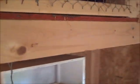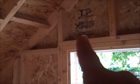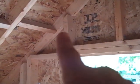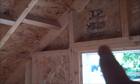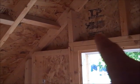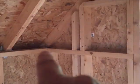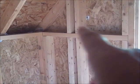And for the wall with the door, I made the door 5 feet 3 because I was afraid that if I went any taller, then it would run into this peak here. But after I've done this, you can make that door at least 6 feet tall and not have a problem with it. So I've framed up the door, and then I added these side walls is what I did, and ran that square.